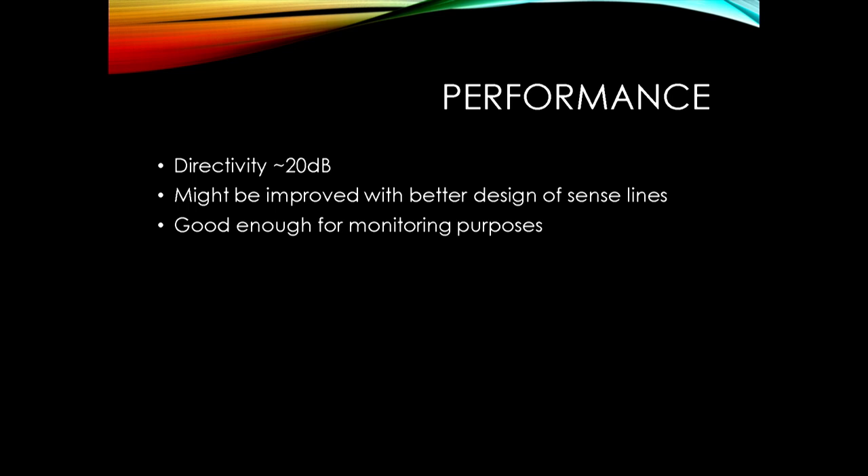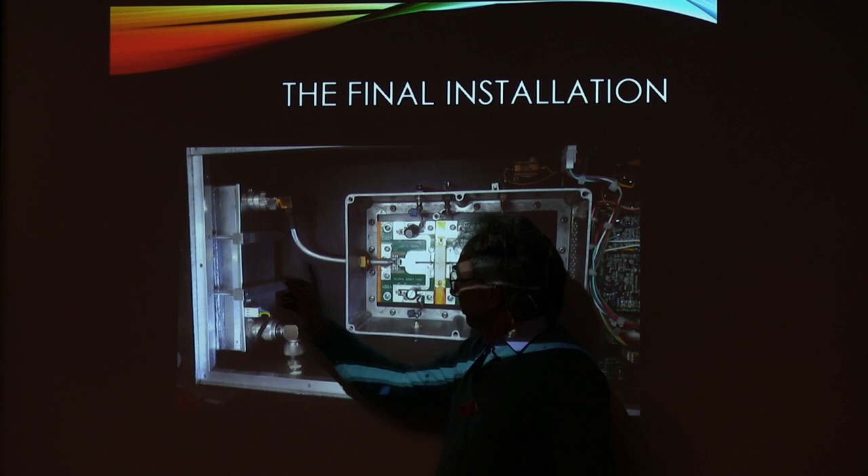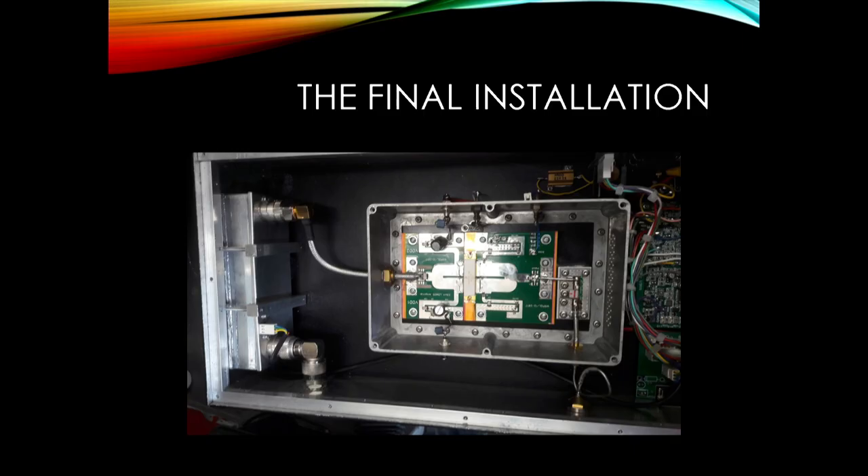It's certainly adequate for measuring forward power and detecting dangerously high SWR. The filter is installed at the PA output in the final amplifier. Without this filtering, if you're anywhere where 5G telephony is being deployed, you'd be causing interference into 2.6 GHz 5G cell sites - that's the key problem this filter is designed to avoid.